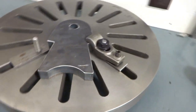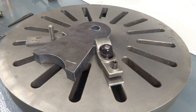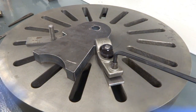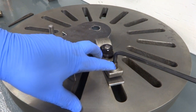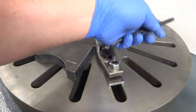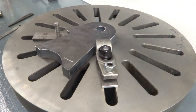Here's the gooseneck clamp after the set screw's been put in. I made a bit of a rookie move when I was tapping the holes — I put the tap in the wrong size tap holder and the tap slipped on me. Fortunately nothing broke or jammed so I was able to recover. What I've done is set the set screw to the correct height so that the clamp is almost touching the jam nut, which keeps everything as low as possible. Now that I've got this at the right height I'll back a nut against it to keep the set screw from moving and maintain the proper position. I just have to do that for the second clamp and then I'm ready to put the face plate on the lathe and try it out.